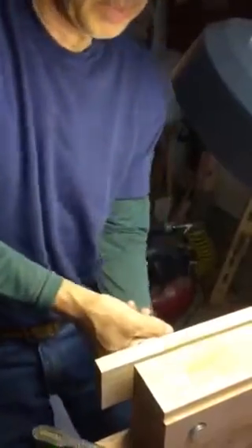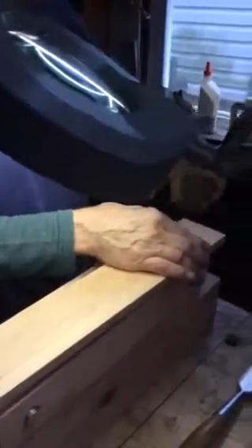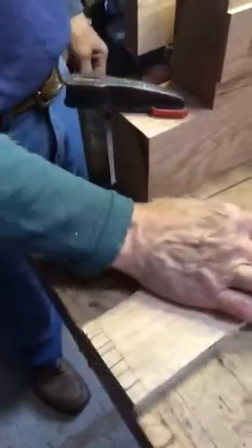Now I go to mark the other side of the line — this marks how deep I want to go, so that the parts I put in will be the same thickness and they'll end up flush. Once they're cut, I have to clamp them down and I'll start to chisel them out.